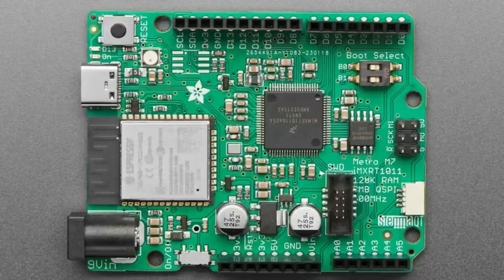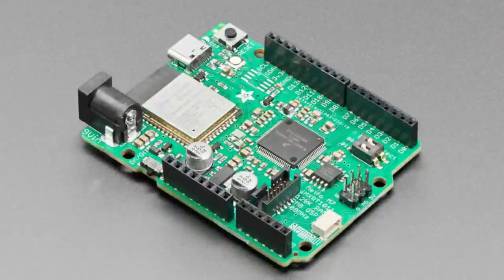We updated the flash to be 8 megabytes of QSPI because again, we like 8 megabytes. We're basically going to be getting this to our developers. We're going to resuscitate the efforts that we put in 2 years ago. We did have CircuitPython running on this board quite well, and we just again couldn't get the chip anymore, so we shelved it. But I think we're going to start getting into Cortex M7 now that you're available. They're a very exciting chipset. After this, we can follow up with other IMX chips as well, but we're starting with the low-cost IMX RT1011.